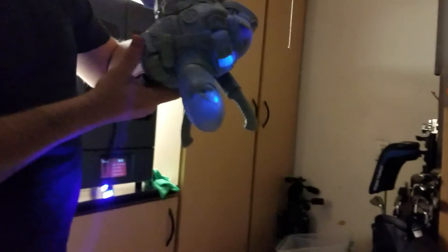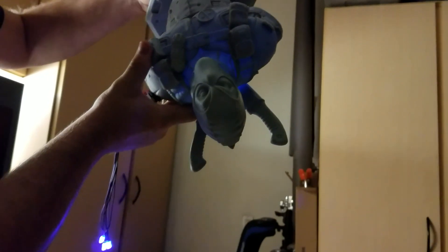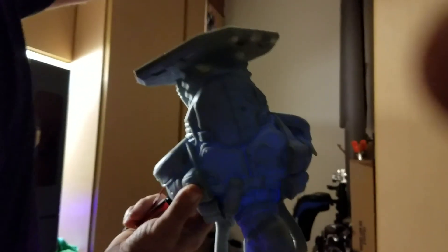What we're going to do is stick these in here. I've got the five millimeters for bigger prints so I can get them in the bigger holes. When I slide these in here, you can see that his head is lighting up on the inside. I can take these lights and move them around to get them into all the little nooks and crannies to make sure I get UV light where I need it to cure the print.